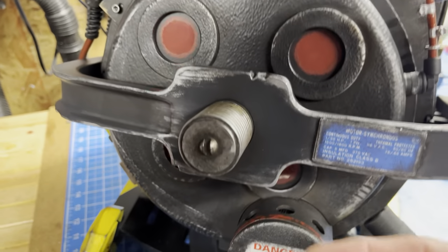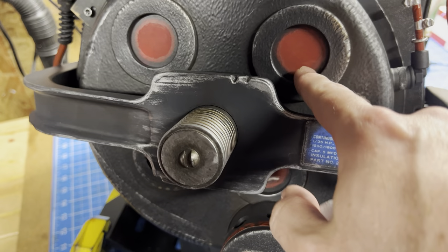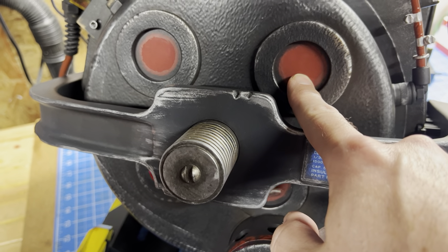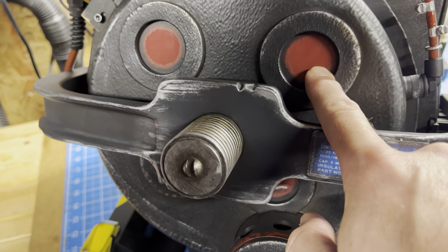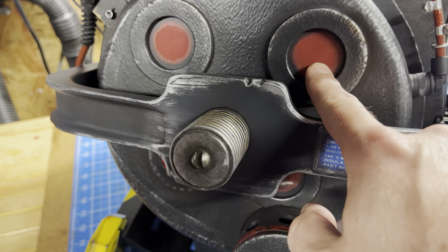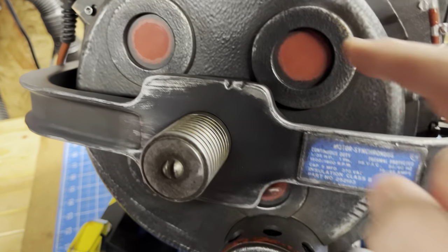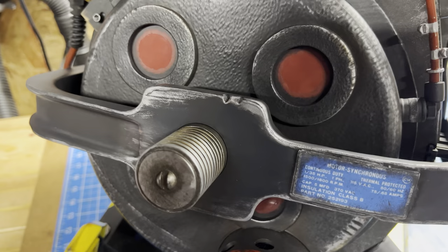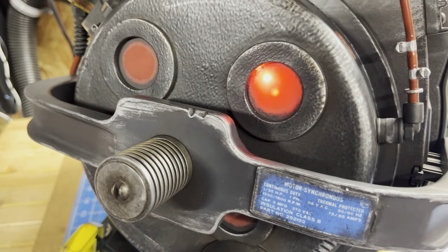I also did the trick of adding two layers of parchment paper to help with the diffusion. So basically I've got several layers. What that does is: one, I can't see the circuit board for the ring; I can't see the individual pixels, which are basically white sitting on a green PCB. So I eliminate that look, and they do appear opaque when the system is shut down.